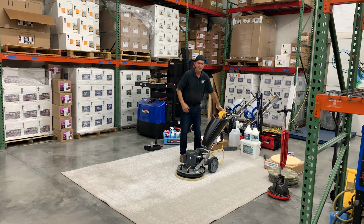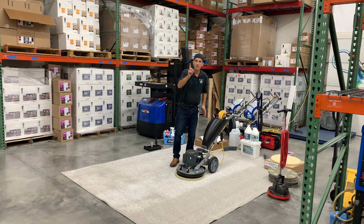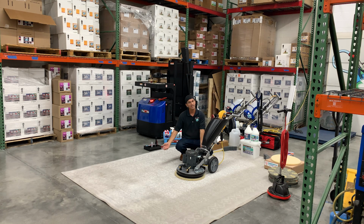I like to personally try to just mix up as much product as I need, or I can take my 2.5 gallon jug, put it right in the drain port, fill up the excess, put in a little bit of water, okay, and just bleed it out through it. What that'll do is keep your filters clean, and you'll hardly ever have to clean them, and your pump will last forever. Hey, there's a nice little tip when it comes to maintaining, right? It's got a weep hole up here.